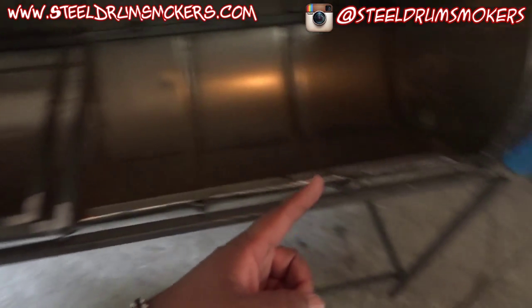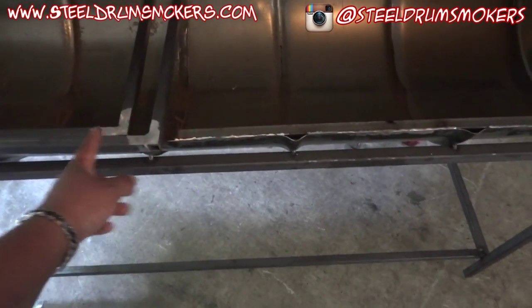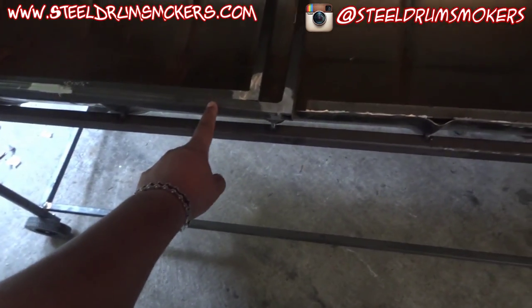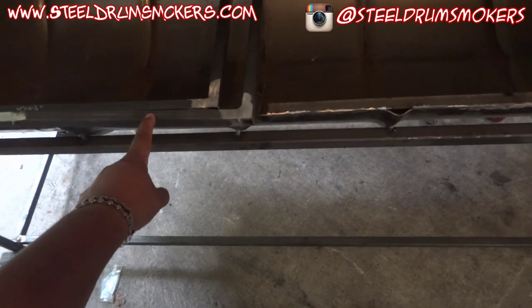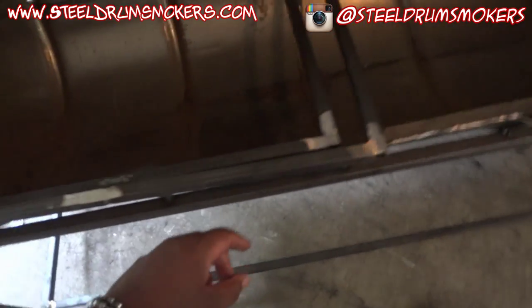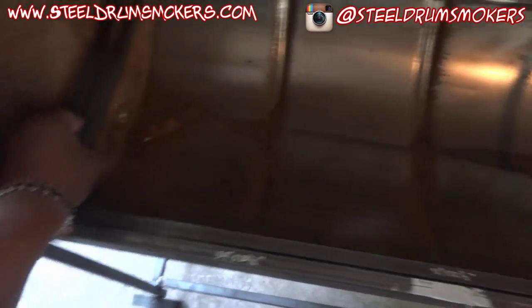I had to shorten it. The problem was: from here to inside there I measured 67 inches. So I said okay, when I was putting the frames for the grates together, I took off two inches - I took the 67-inch bar and cut it in half, so 33 and a half inches. Then I said, well if I mount this to the end I'm going to have to account for this inch here and this inch here.